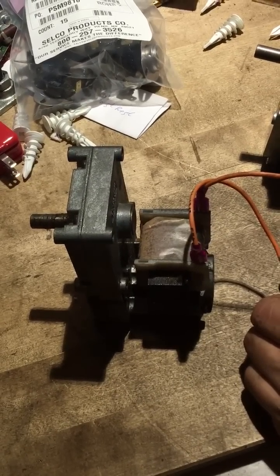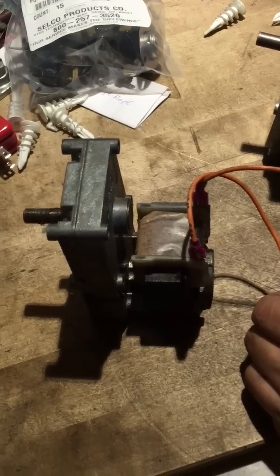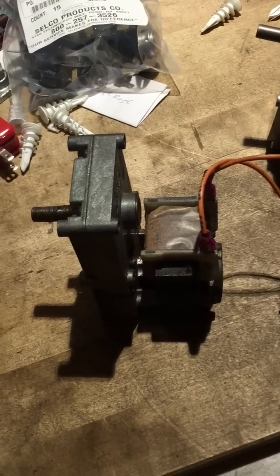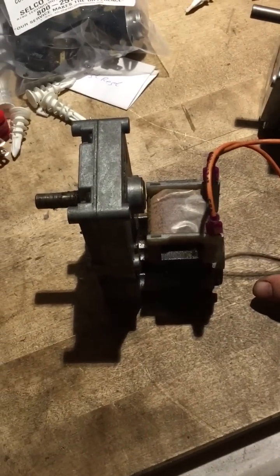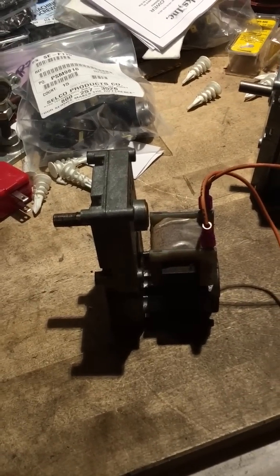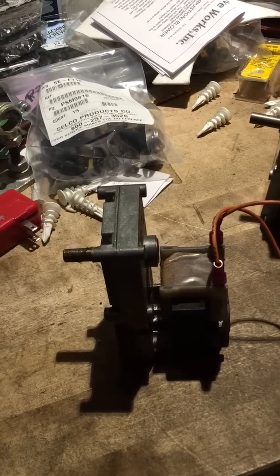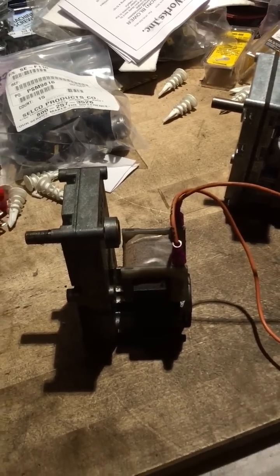What I want to show here is how an auger motor should sound. This first motor does not have the best bearing — it's an older motor with curved magnets and it makes kind of a rattling sound. This cutting board will help amplify the sound to make it a little bit louder for the demonstration. In the pellet stove it's not on a sounding board, so it won't be quite the same.